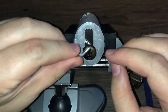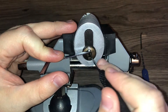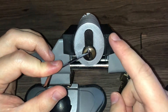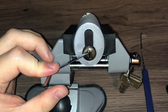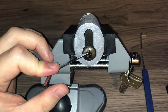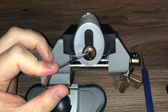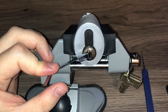To start, once we have our tension wrench in place, the first thing we need to do is set the ball bearing. Once we do that, we can see we have a nice deep false set. You shouldn't have any issues with your tension wrench blocking the passive bearing since they don't come into play until they're aligned with the passive drivers located down the center of the housing — this doesn't occur until you've turned the plug a little bit over 45 degrees, and the lock will be very open at that point. Now that we have the ball bearing set, we're going to place the magnetic shielding against the opposite row of rotors that we'll be picking. We'll need to switch the shielding from one side to another depending on which side we're working on, so that we don't undo any of our work.